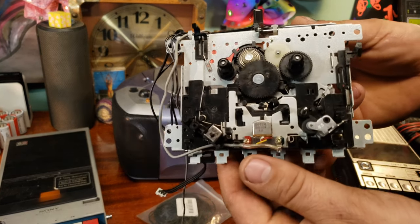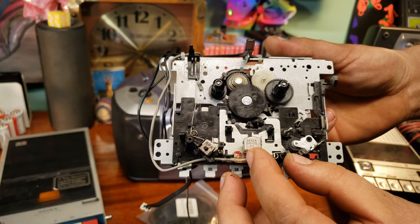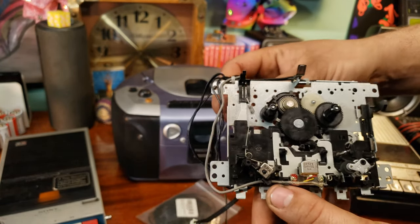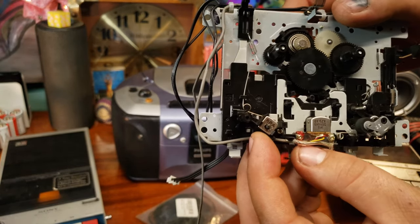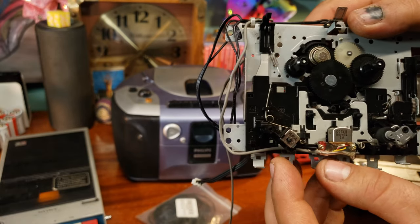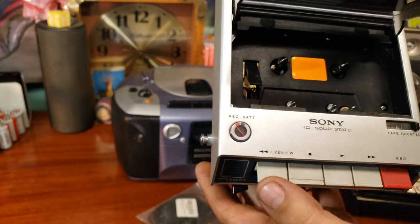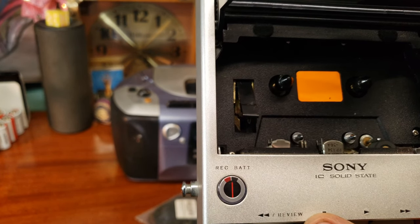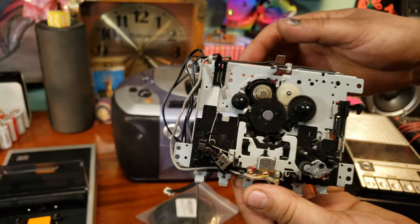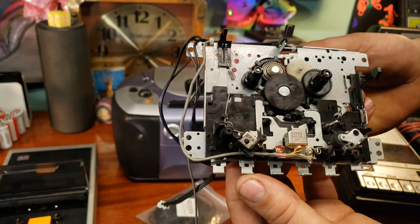Let's run through what the tape mechanism actually does. Starting at the front, this is your play head — it collects the information from the ferromagnetic tape passing across it and makes a signal that it sends back to your amplifier. This is your erase head. Because it swings down out of the way, that means it is a permanent erase head, which is less favorable. Even this primitive old Sony has a standard AC erase head, and no matter what, even when you're not in record, that head comes up with the play head.